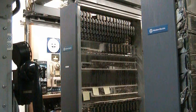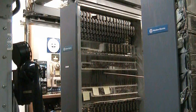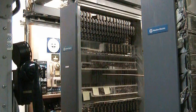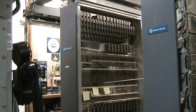Also, for outgoing calls, such as toll calls, the system also has to have line equipment number to directory number, so that it can put that information into the sender and then send it off to the toll office. So the LNT does 2 functions. For internal calls or external calls into the office, it looks for the phone number to see what equipment it's wired to. Then on originating calls from the crossbar to the world, it looks at the line equipment number to determine the phone number.